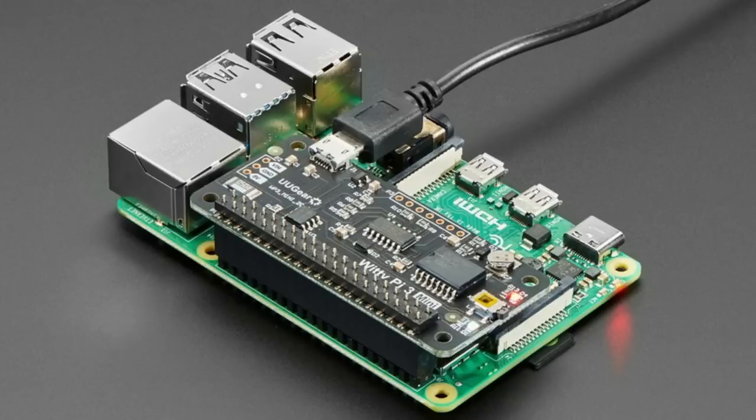You can see there's a little capacitor. It's a large capacitor, but instead of a coin cell, it's got a capacitor that auto charges when it's powered up. And basically it can be used for automating control of your Raspberry Pi without needing any external soldering or anything. It just plugs right in, and then you just have to power it through the USB port that way so it can shut off power when the timer goes off.